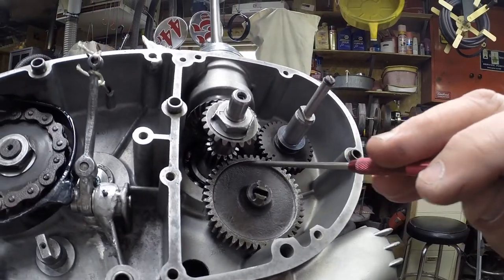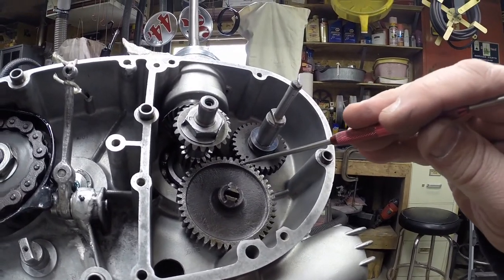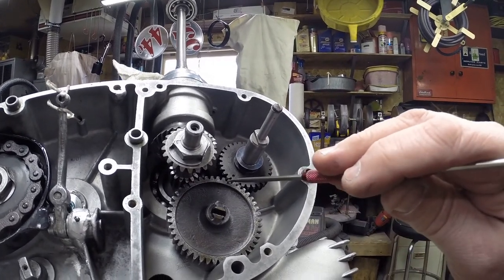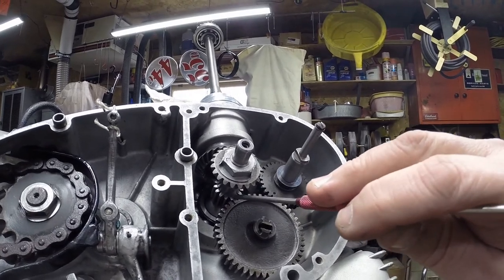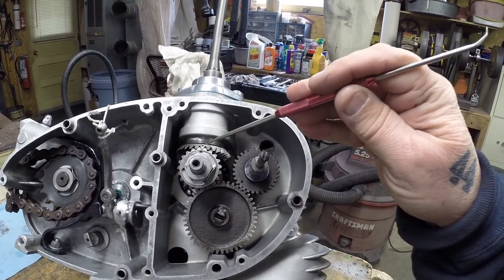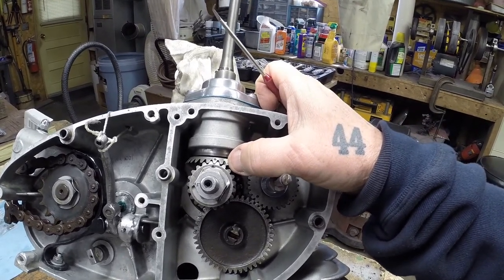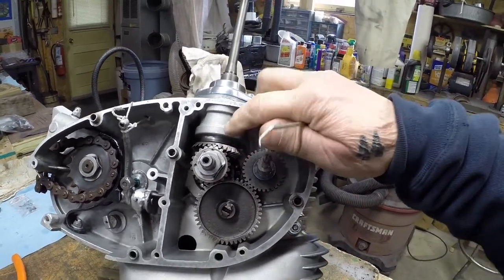This is part of the crankshaft. And then this female lines up with this male. So there's a mark here and here. This one obviously lines with the timing gear. This one lines up with the crankshaft gear. And this is also a driven gear, the bevel driven to the vertical bevel. And I'll be quiet just so you can hear. Just the tiniest amount of play there.